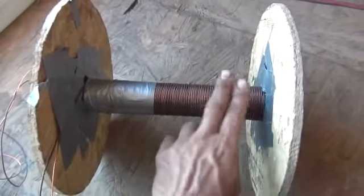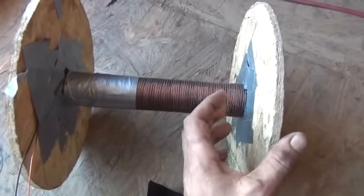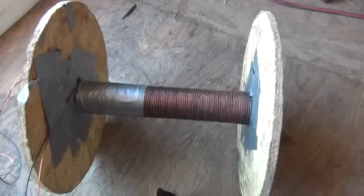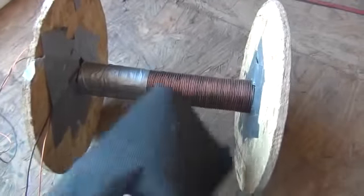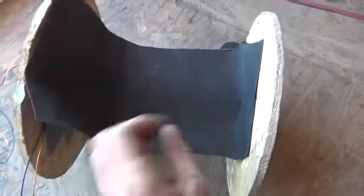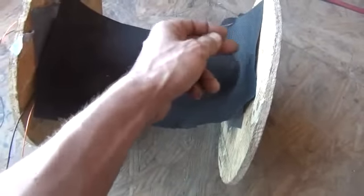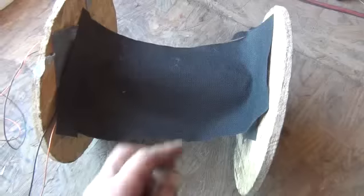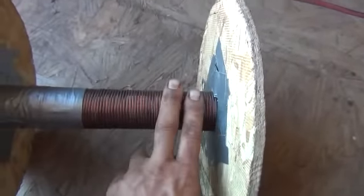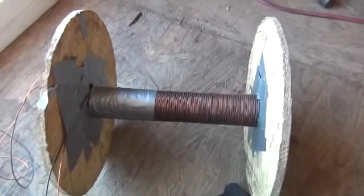Alright folks, we're done now with our second wrap. We're going to try to fill most of this spool up, which will be a long process. I probably get four or five of these done a day before my hands give out on me. Now that we've got our second wrap, I'm going to take another layer of this material and wrap that coil all the way around. It sticks up against the inside edges as it wraps around, so I have to make little splice cuts to relieve the pressure of the curl, and then use tape to hold those down. That just makes sure the coil above can't slip to the coil below. Let me go ahead and take a break, throw that other layer of insulator on, and start wrapping our third layer of coil.